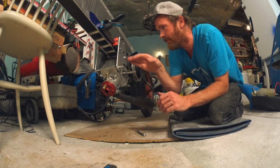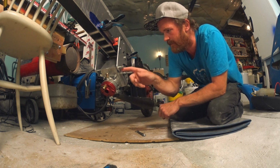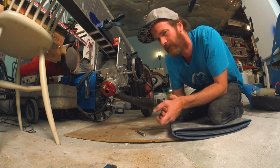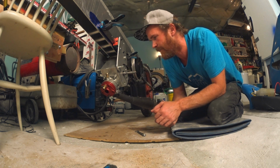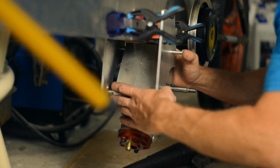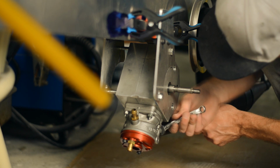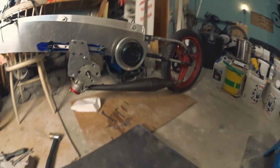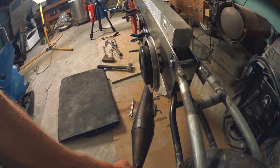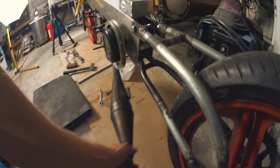2 days later, last time I made the engine mount plates. Looking at it now, I can see that I made one of the holes in a slightly wrong position, because as you can see, the pipe is sitting kind of low. So I'm going to re-drill that hole and then finish these mounting plates and make some spacers. That's better. It's not going to sit this far out, but I need to make the spacers here to have it stiff enough, because now it's standing there. Now it's wobbling about.